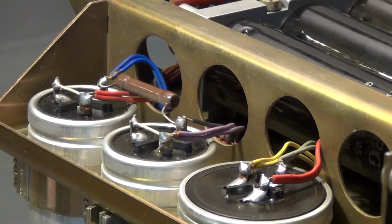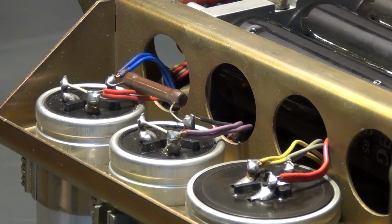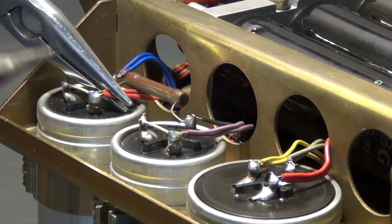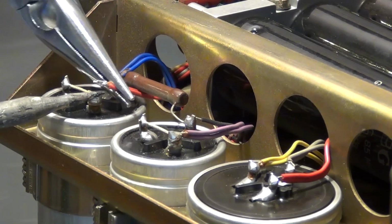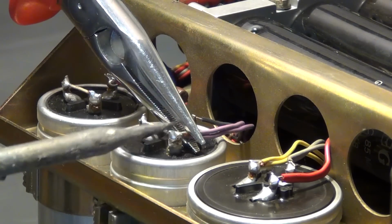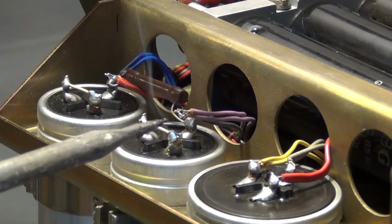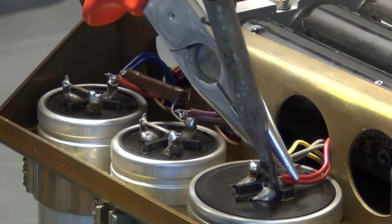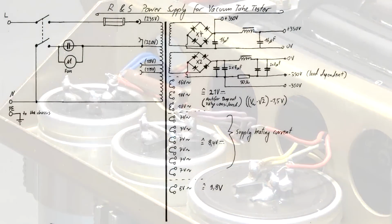By the way, the large capacitors which we saw inside the power supply unit in part 1 were not, as I thought, electrolytics. They too were metallized paper capacitors. In fact, I did not find a single electrolytic capacitor in the device as of now. That, however, is a good thing, since MP capacitors have some advantages over electrolytics. They are, for example, non-polarized, which makes them more versatile. But so much for the teardown. Let's come to our actual project.